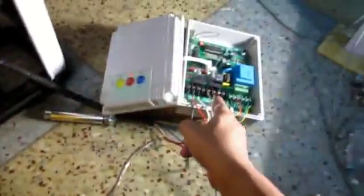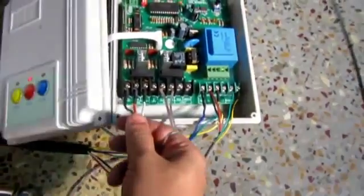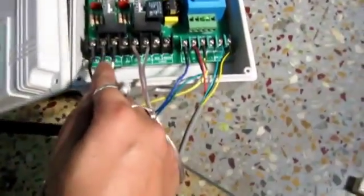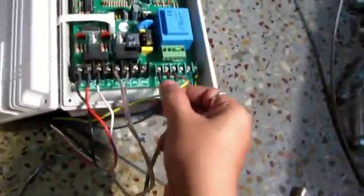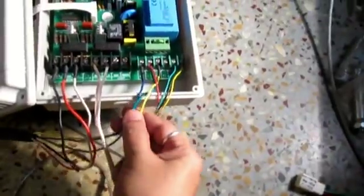This is the BB-406 type — the control panel can be kept outside. This is the control panel which you can keep in the control room by extending the six wires. The first three wires — black, red, and white — go to the motor: L1, COM, L2. The other three wires — OL, V+, and CL, the blue, green, and yellow — go to the limit switch.